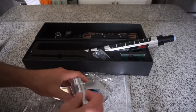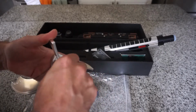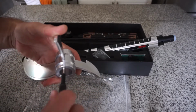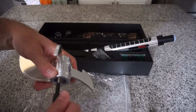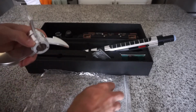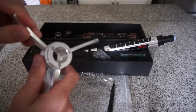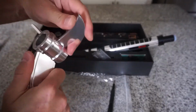Okay. So a little bit of blue Loctite on all the screws. Heed my warning. If you're going to use Loctite, literally just a little bit, not even the size of a pea, size of a rice. Think that small. That little amount goes a long way. So you're good, right? And even without the blue Loctite, that feels nice and secure.